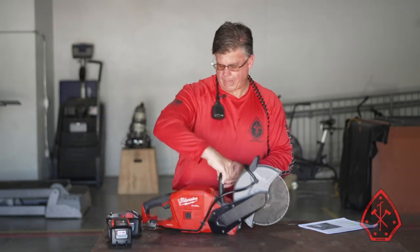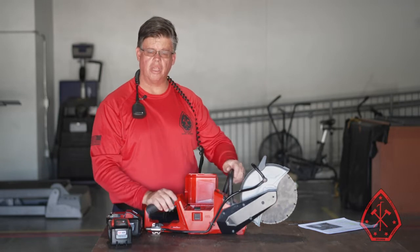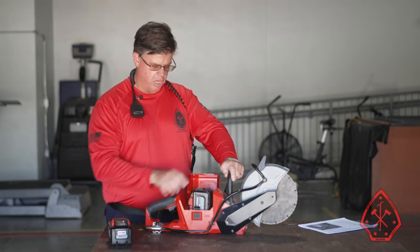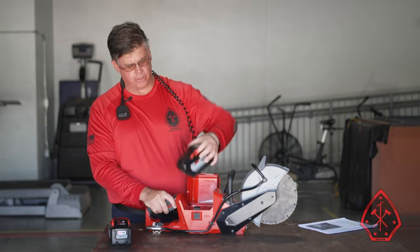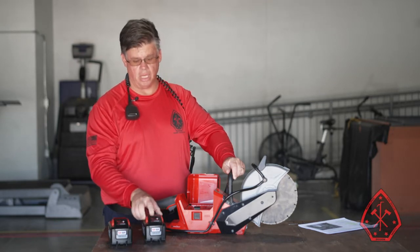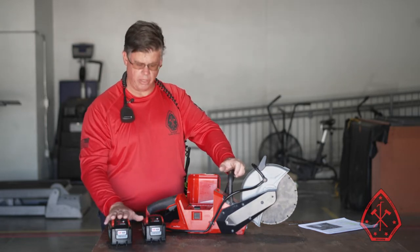Let's go through a battery swap. The battery compartment has a small latch on the side — it just opens up. The battery compartment door is relatively fragile, so make sure you don't drop the saw while putting the battery in. Battery goes pins down — when you slide it in, be careful not to bend any of the battery pins. You should hear a positive click indicating the battery is locked in place. To remove the battery, squeeze the red pins and it should slide out easily. If you do a lot of heavy steel cutting, the batteries will overheat before they run out of charge — the indicator lights will flash indicating the battery is overheated. Having multiple batteries will help, so you can just swap to a fresh one. Then close the compartment.